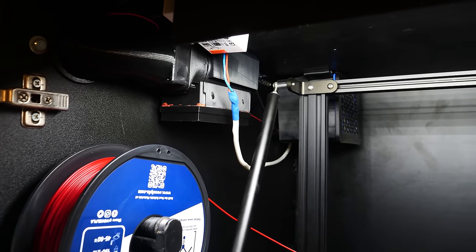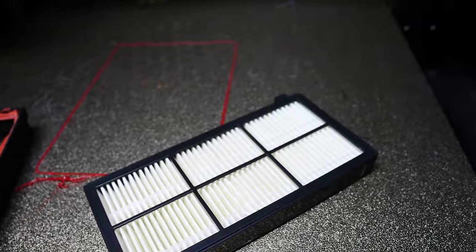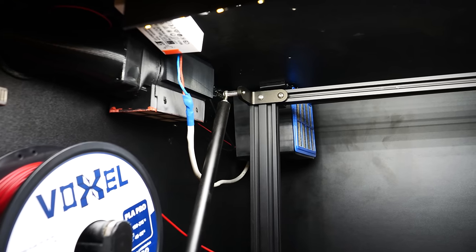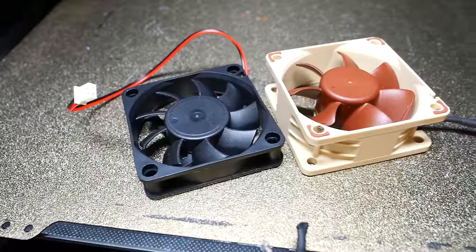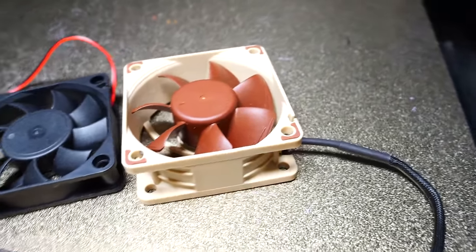For all these reasons, I printed and installed yet another filtration system as an exhaust design. It uses the widely available HEPA filter from a Roomba robotic vacuum, paired with some squares of cut-up activated carbon, mated to a custom-made tube I designed in Onshape to create a smooth 90-degree angle. I also designed and printed a custom, much more sturdy sliding bracket for this system so I can quickly and easily swap the filters and activated charcoal. I've been trying different fans — going back and forth between more powerful ones and quieter ones — and I think I'm going to switch back to the Noctua 60mm fan, because the proximity to the wall means it can get really loud if it's not ultra-quiet. This entire housing is connected to the same circuit as my other fan, with a 35-degree Celsius temperature switch, so it only activates at higher temperatures.